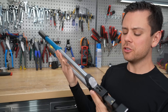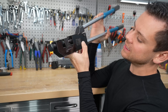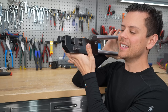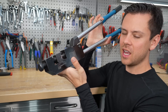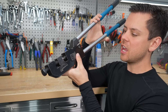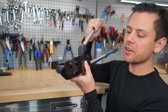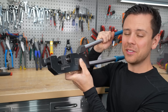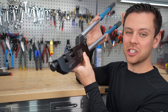Now this is not a new tool, but everybody in electrical for low voltage DC should have it. It's the Temco Industries TH0020, and this is hands down my favorite crimper for large conductors like 4-aught or 2-aught gauge cables. It is so durable — everything about this thing is incredible. It's like $150, but with all the cheap crimpers you're going to end up buying over the years, just buy this.